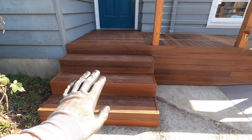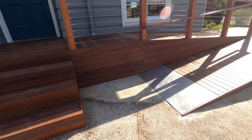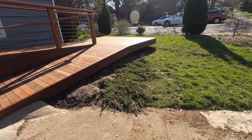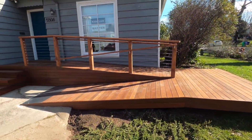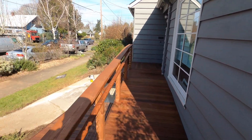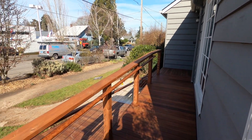I'm back at this job one last time. I'm going to quickly stain these handrails, which are the raw color right now, and I'm also going to put resin epoxy on top of the top cap. I do have to let the railing dry because that epoxy won't stick to an oil-based stain, so I'm going to come back again and put epoxy on the rails because I want that stuff protected and I don't want it twisting and changing over time. As you can see, I had some unoiled pieces of the fascia — especially on the stairs, those lower pieces — I got those all oiled, including the fascia out here. Then I went in and stained this handrail, getting all of the surfaces including the bottom. That's going to set up and dry today and really soak into the wood. It's a pretty rough surface, so when I go to put the epoxy tomorrow it should set up really nice.